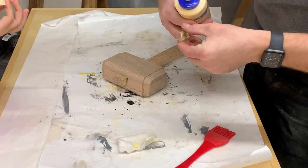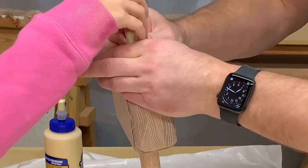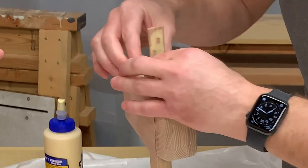We quickly discovered one problem of having a thin curved slot for the wedges. The first wedge went in easily, but closed up the slot for the second one. So it took some really awkward prying before my shop buddy was able to get the wedge to fit in.